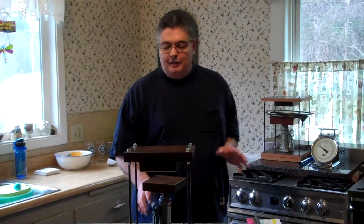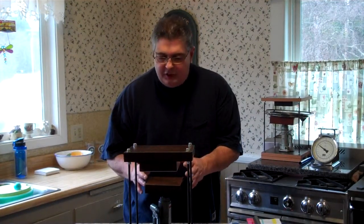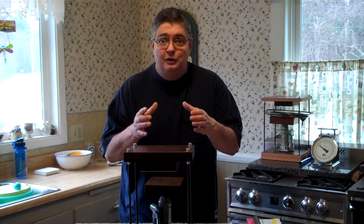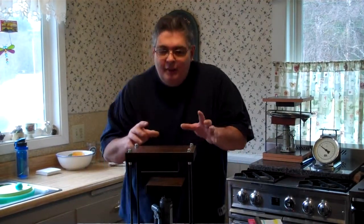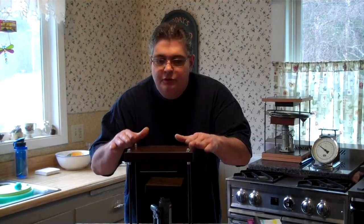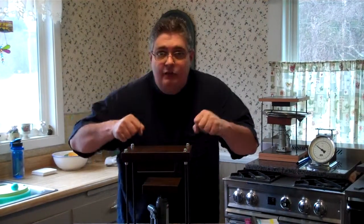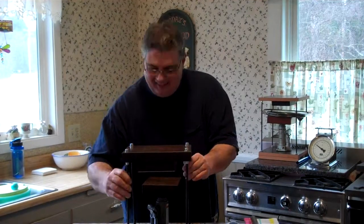And one thing I'm very proud of is that you can actually take all the pressure of this jack and concentrate it in a 5.25 by 5.25 area and not have any flex this way. Maybe a little shifting, but I learned that if it's shifting a little bit, and this is for anybody that's got one, back the screws off just a tad. They don't have to be completely tight and cranked, because when you do that, it'll start turning it like this. I love that.